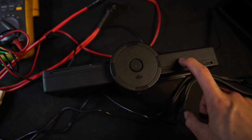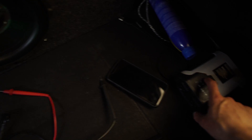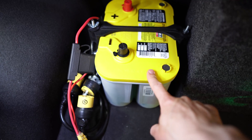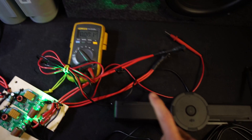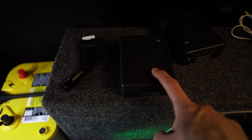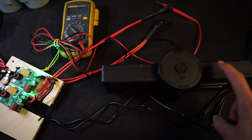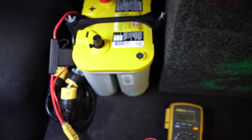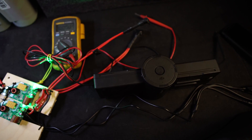I have two pairs of batteries here. This one is at 18% and we're going to charge it using these converters. The other one is at 24% and we're going to give the inverter a little bit of an advantage. I've measured the float voltage off of the yellow top and topped it up with the NOCO, and we're going to see what the voltage drop is so we can calculate the amp power usage — charging from 18% using just DC to DC, then charging the other pair from 24% to full using DC to AC to DC, to see what the difference in efficiency is. I suspect we'll get a little bit more juice out of the DC method because we're not losing anything to heat as we would with the regular Inspire 2 charger off of AC, so it'll be more efficient.